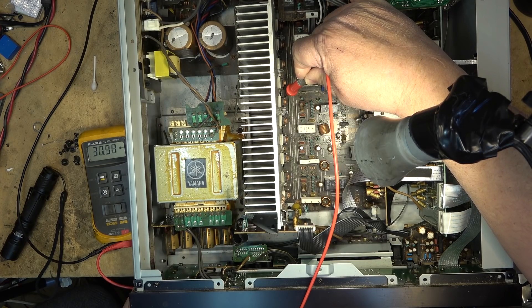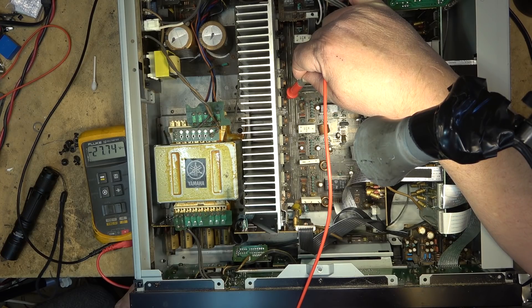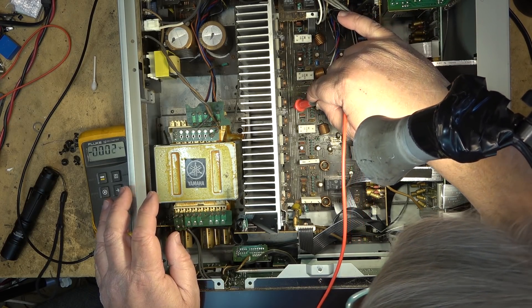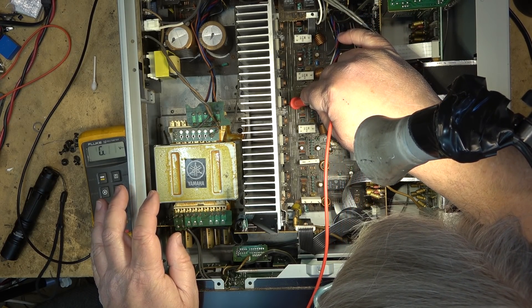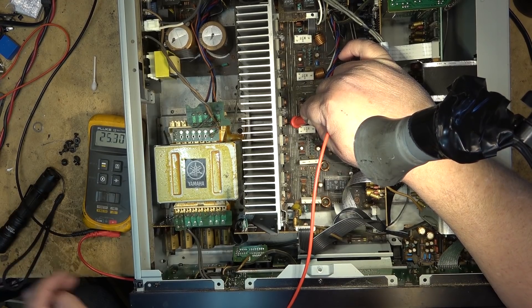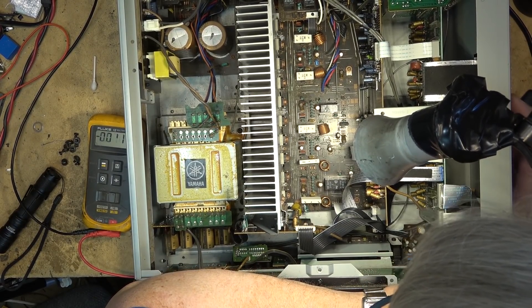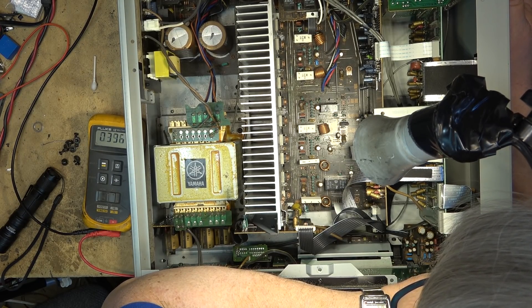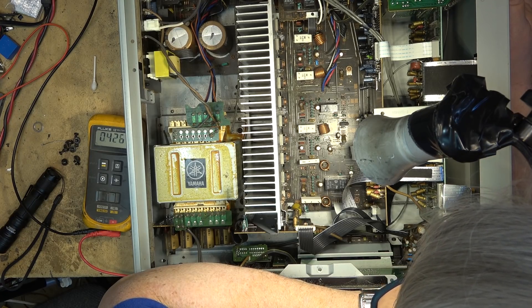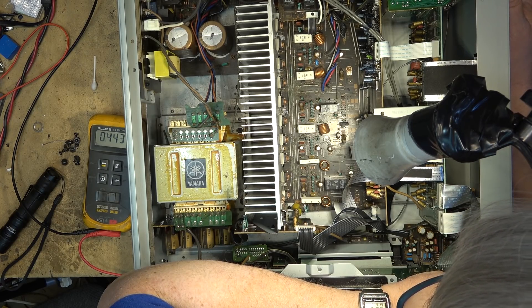You've got 31 volts on the transistor, and the middle terminal — the collector — will have your full rail voltage on it: 52 volts. This transistor might be open. I'm getting 51 volts, 18 volts, 31 volts — that should not be there, that should be at zero. Now I don't know if that's the center channel or one of the others — this is a multi-channel unit. I could cut that transistor out. If it's the center channel, he doesn't need it — he's just looking for left and right. Being the pair of transistors in the middle, that might be the center channel. Somewhere in this area there is a problem.